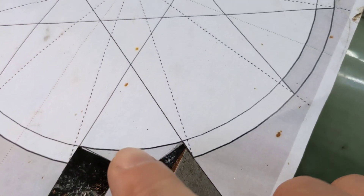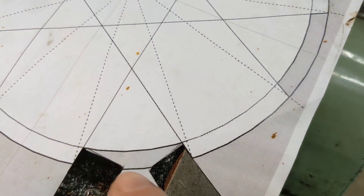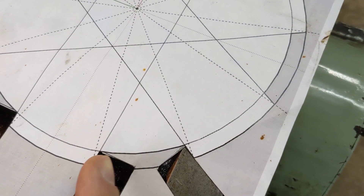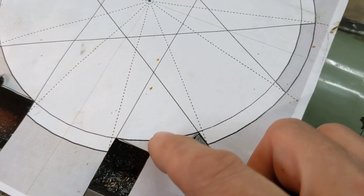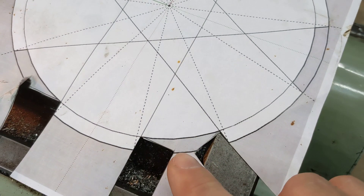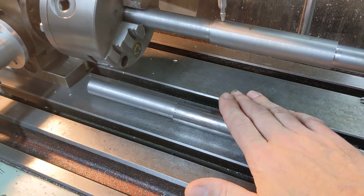You're left with a little triangular piece in the middle, and then we run a straight mill cutter right down the center. Then you've got the right angles on the splines — a little bit of the inner diameter is missing, but that's fine because splines locate on the outer diameter, not on the inner diameter, and that gives you a nice clean finish.